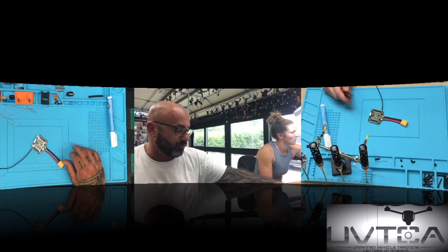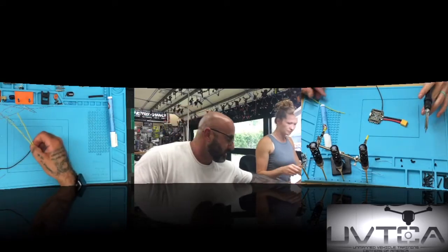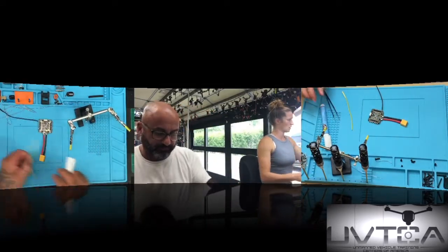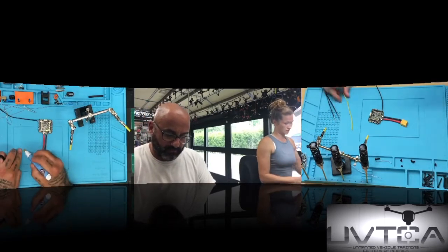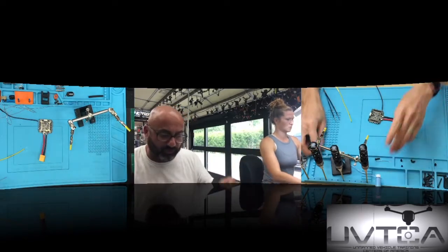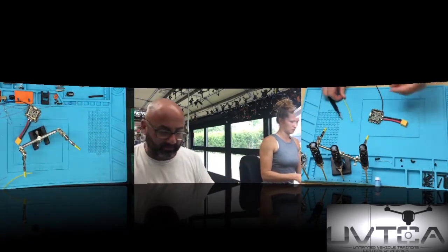All right, so now let's go to the yellow one. Here's your yellow. Don't forget, you've got to tin it first, so you put your flux on there. Normally you would have already tinned all of them, and then you just go through the movement. But I put solder again on the wire? Yeah, that's tinning it. So now you're going to tin it.